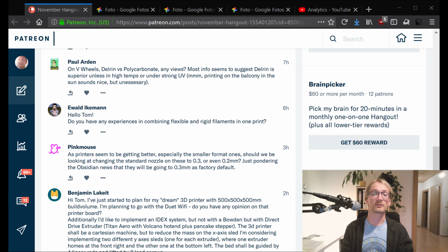Ewald is asking, do you have any experiences in combining flexible and rigid filaments in one print? So first of all, dual extrusion prints are tough to design. You do need to know your CAD system really well if you want to do a dual extrusion print. The other thing is you are going to need to find a printer that does flexible and rigid materials. So something like the Prusa multi-material with a single nozzle could work, but you probably want something with 2 different tool heads. So Ultimaker 3, Sigma, other machines that have 2 separate nozzles.